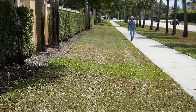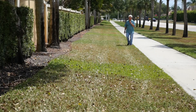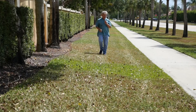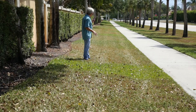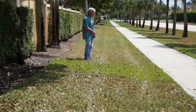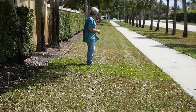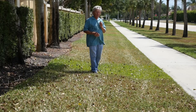This landscape irrigation system is completely inefficient because it was designed improperly. The sprinklers fixed in the ground do not have head-to-head coverage — in fact, they don't even overlap. As a result, the one time of the year in the dry season when we would like the irrigation to actually do something, it fails. It leaves us these green islands in a sea of brown. If this were designed on a layout, either square or equilateral, with head-to-head coverage and overlap, it would be far more efficient — we could use less water and still have green grass.